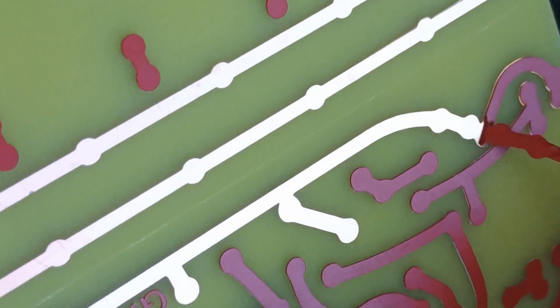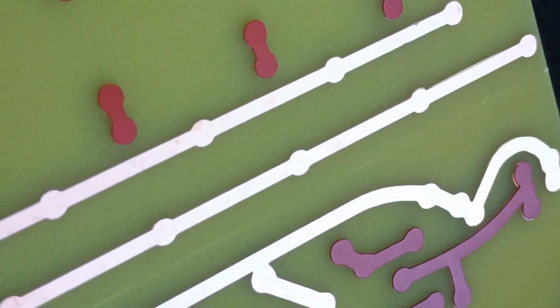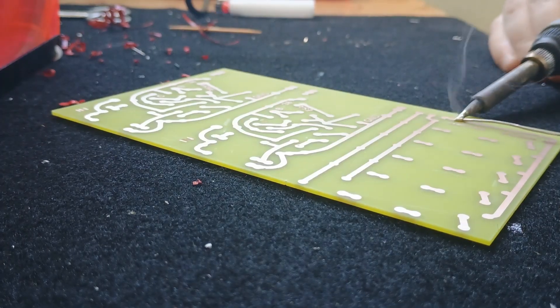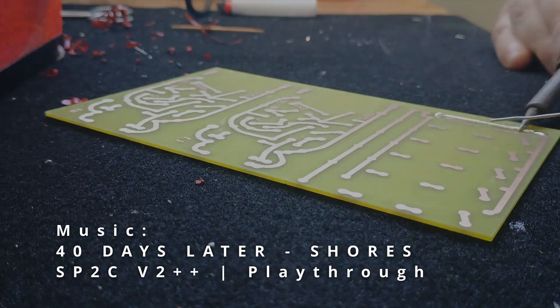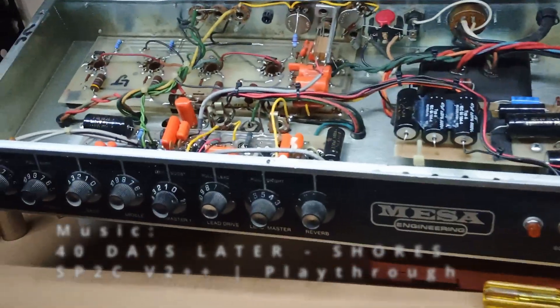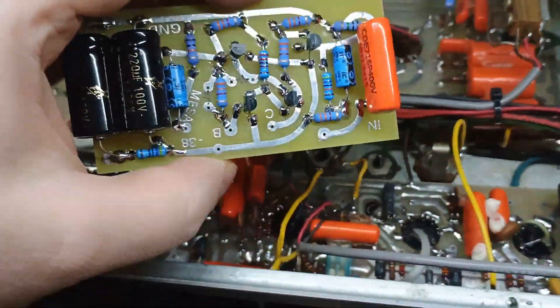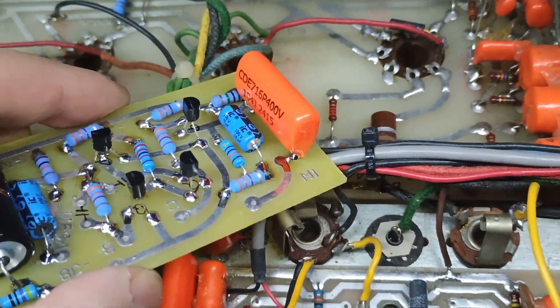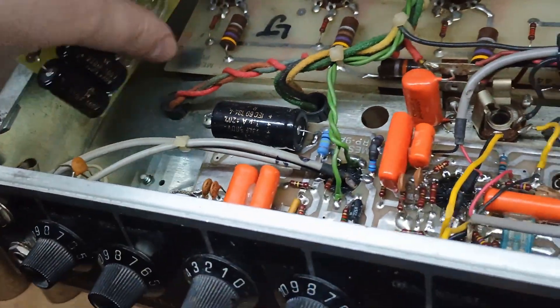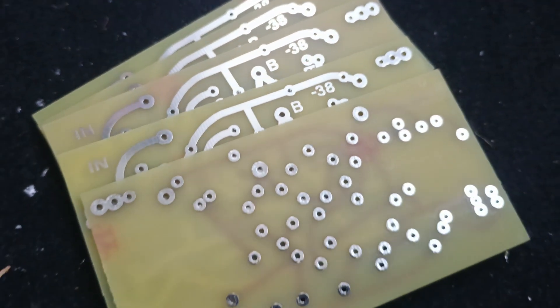After the etching process, peeling the resist foil layer leaves only the bare copper traces. Then they need to be tinned and drilled. After this quite boring-to-watch process, it's time to populate the boards. Here's the finished driver board, using my own etching, because I wanted to use manual fabrication as much as possible for this project. I will keep the double-sided driver board aside for future builds.